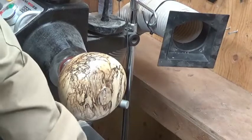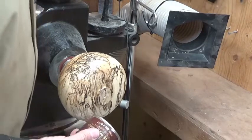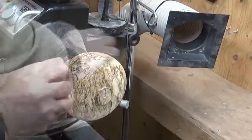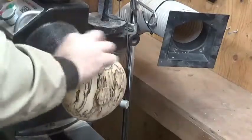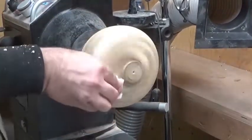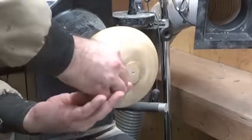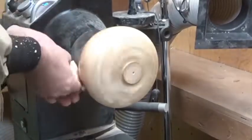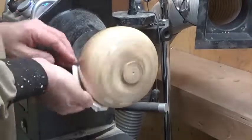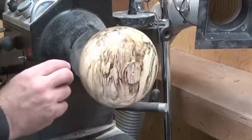Okay, so there's no more product coming off on the towel, so now I can apply Hampshire Sheen Gloss to the entire surface, and then I'll let that set up before I buff it in. Now this is the food and toy safe. Okay, that is now set up. It's gone tacky, so I'm going to start buffing that in. And that is rather lovely, very shiny, nice finish.